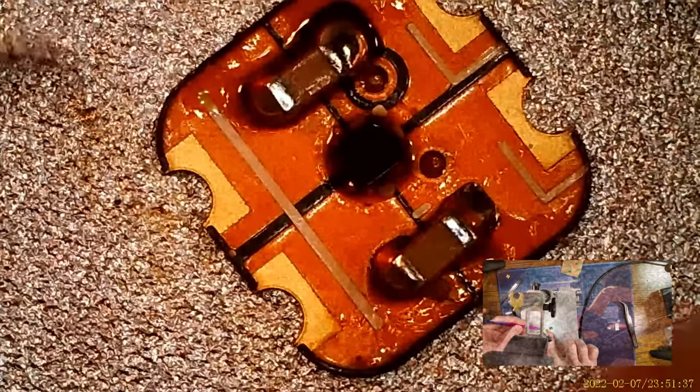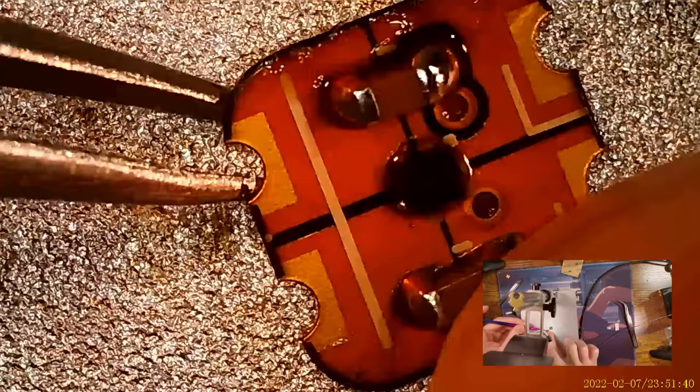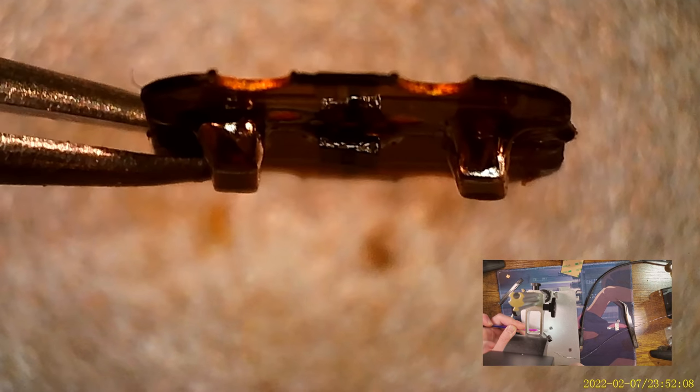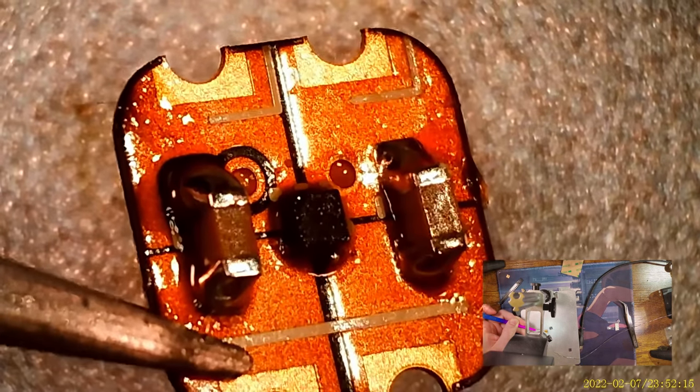My concern is there's that random solder ball right under the chip. Let's investigate. Yeah, I'll have to clean that out to see what's going on. Look on this side. See, it looks crooked. That don't look good. With how cheap these things are, it's probably easier to just factor that into the budget. If you mess up soldering one, just throw the chip out, because they come with the balls already on them. I will come back to that one later.